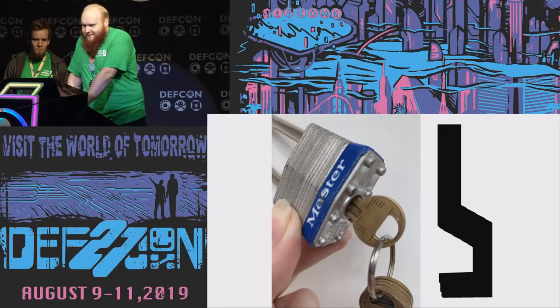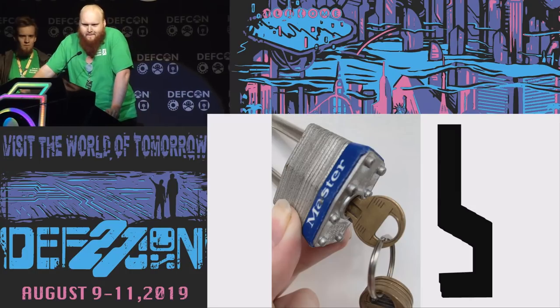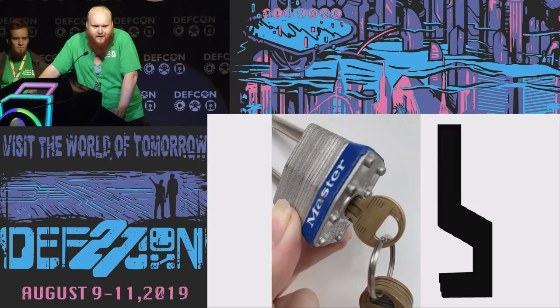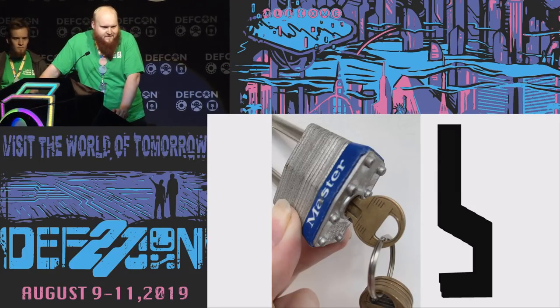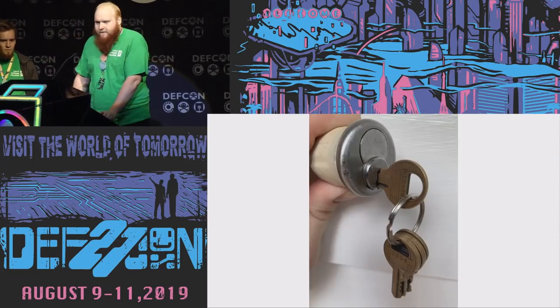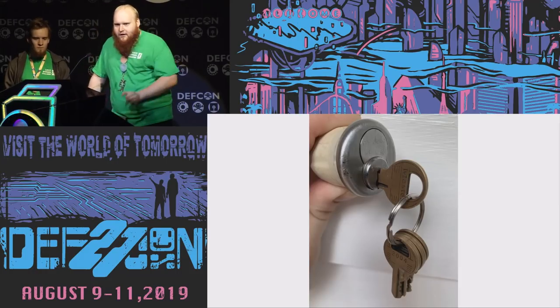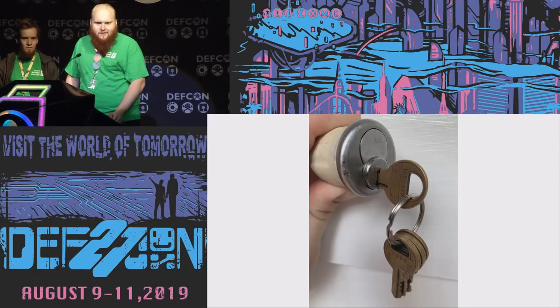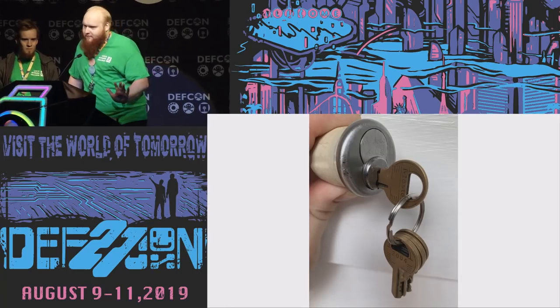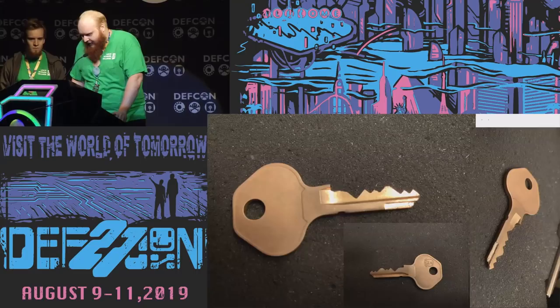Master Lock. Most common padlock in the country. Most common padlock keyway in the country. Fits, unmodified, in a Medeco M3 lock. Not quite all of them. Of the ones we tested, about two-thirds, but that's a bit of a problem.